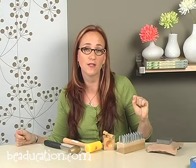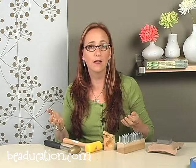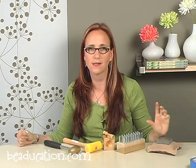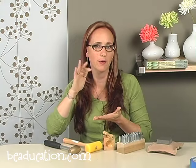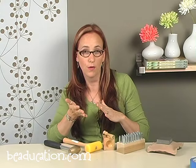Oh, we get questions on, can I stamp on the back of my pendant? You can, but you need to have a much thicker metal. It's not going to work on 24 gauge. You'll notice that when you stamp on the top, it punches through a little bit on the back, the indentation of the letter. So if you bump it up to a thicker metal, you will be able to stamp on both sides, maybe like 18 gauge or thicker.